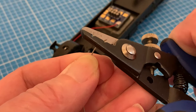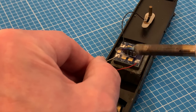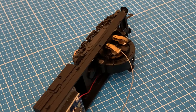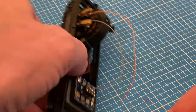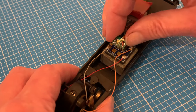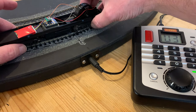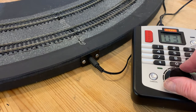Now for the grey wire which goes to one of the commutator brushes on the motor. DCC wiring may seem complicated but actually it's incredibly simple - the red and black wires take the alternating current from the track to the decoder which outputs a variable direct current to the motor via the grey and the orange, so all we're really doing is splitting the original wiring into two halves with the decoder in the middle. Then to finish up I need to do the same thing with the orange, soldering one end to the sprung brush assembly and the other to the square pad on the socket. Now all we need to do is fit the decoder itself just making sure we get it the right way round before pushing the pins into the socket, and everything works as it should - accelerating smoothly under DCC control in both directions.